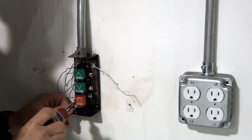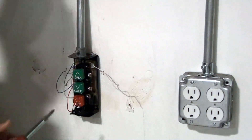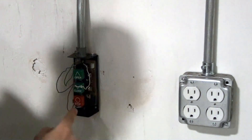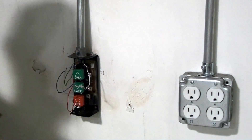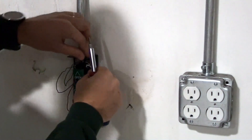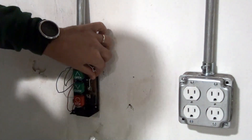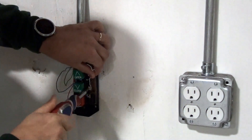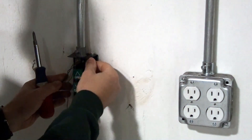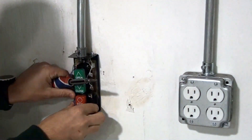Once those three wires are connected, you'll need to connect the common wire. Some common wires are connected to the bottom terminal of the three-button station. You cannot connect to the bottom terminal on the PB3-DRC — you'll need to connect to one of the top two connections. Either one of them is fine, as they are all bussed together. Once your wires have been connected, dress them inside the box so the cover can be installed. Then attach your mounting provisions.